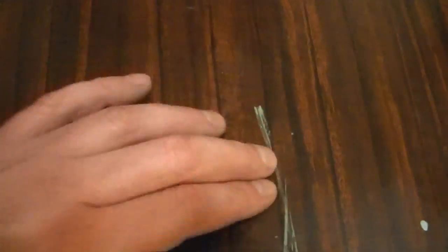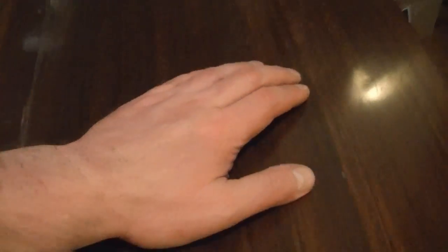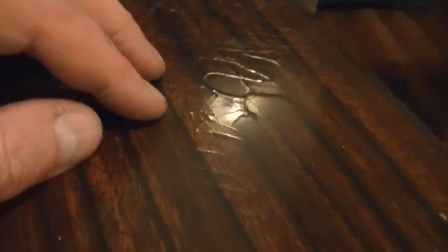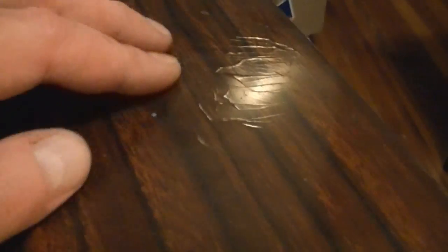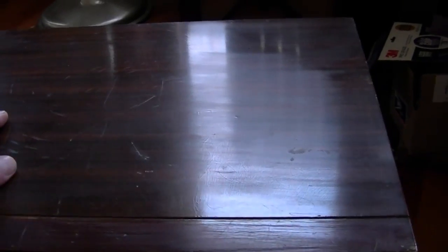As far as abrading it, it's going to make the surface dull where I go over with the steel wool. But my plan is to lightly sand down this whole thing and then put on some fresh lacquer to take care of this crazing and fill in any voids. Most of it's not too bad, but I notice in this area it's kind of like a spider web of alligatoring. It was actually rather easy to get that paint off — I did switch over to 600 grit sandpaper in a few areas though.